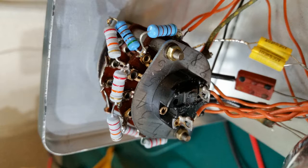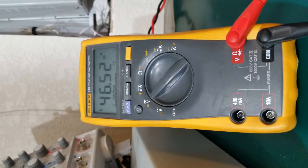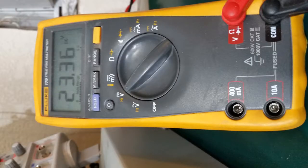As these kits were produced, they actually put out around 40 volts on that setting, and that just didn't seem right to me. You have the front label saying 25 volts, and the specifications in the manual saying 25 volts. And when you do the calculations on the resistors that were in there, it comes out to 40 volts on that setting, and that's what I was measuring. So I made a modification to bring that voltage down to 25 while leaving the rest of the voltages about where they were, pretty close to 150 volts, 250 volts, 350, and 450 volts.